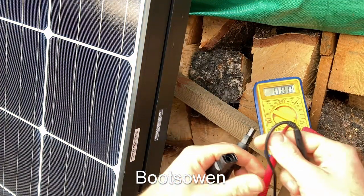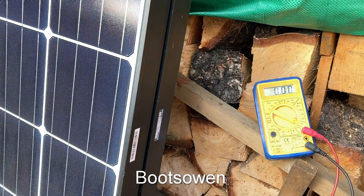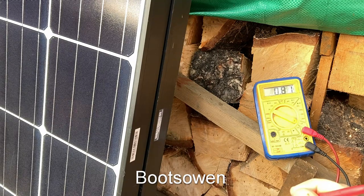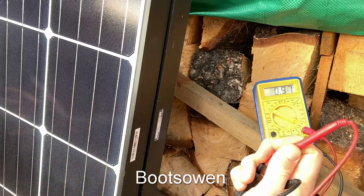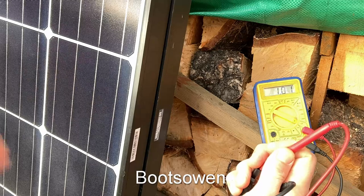So we've got negative, and there is no sun at the moment. So this is an overcast condition, and we're getting 0.84, 0.8, 0.83, 0.81 of an amp, which is pretty low, 0.9, 0.93. As the sun comes out and as the sun moves around, you get more. And I think if I was to obscure it somehow, my hand isn't big enough because I'm fighting the sun's coming out as I put my hand over it.